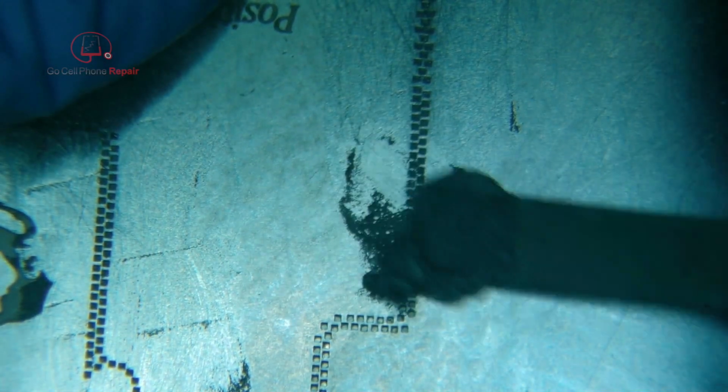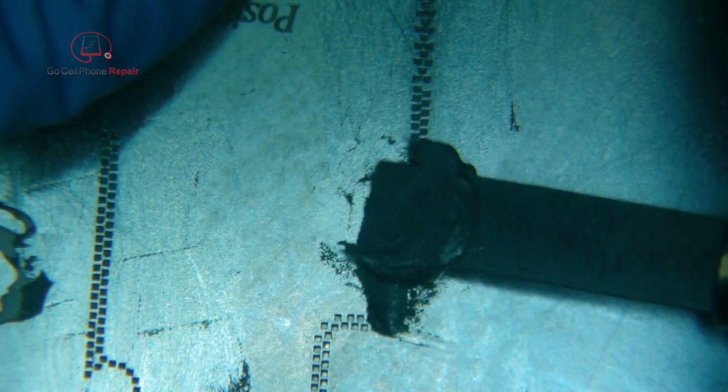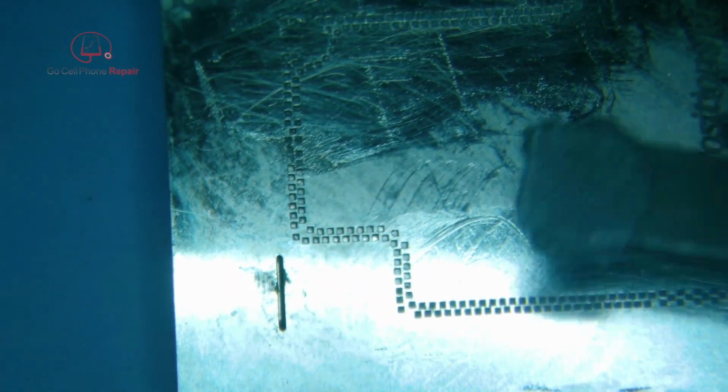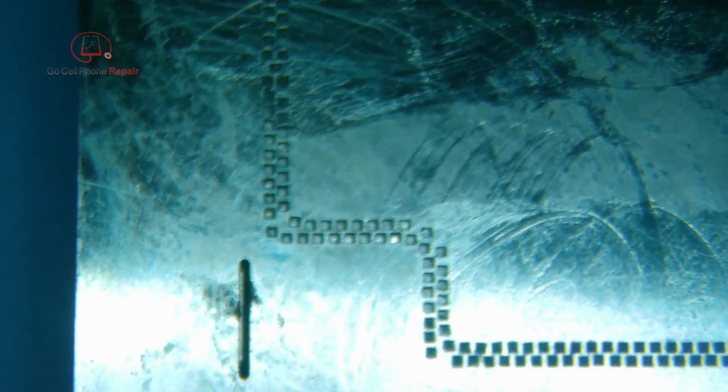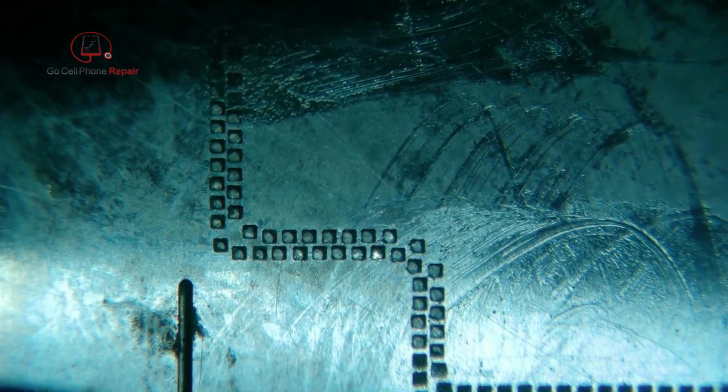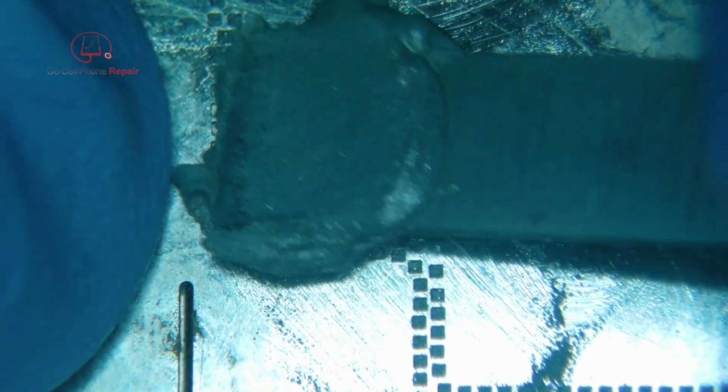Now it's always possible you have to touch up a few of these, add a solder ball here and there, or maybe separate some that got fused together, but as long as it's not too many, it's not a huge deal. Now over here you can see this thing's lifting up, which is really annoying, so I'm going to push down on it. Moved it there just a hair, trying to get better aligned. You don't want it jumping up and down the whole time.